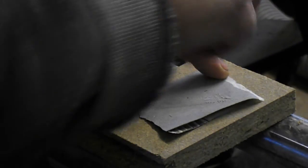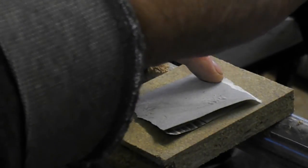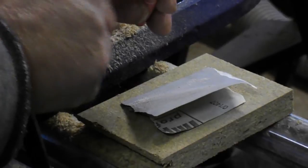There you are. Okay, that one's down to the brass tube now as well. This one, about a millimetre or so to take up. Doesn't take long really at all. But I find this is the best way, is to cut the glue on the mandrel. Especially when you got as much glue as this. Obviously, if it was just a wooden or an acrylic pen with one coat of glue on it just to give it some shine, it wouldn't really matter a lot, because that one coat of glue would snap really quite easily.